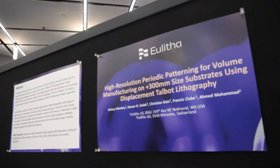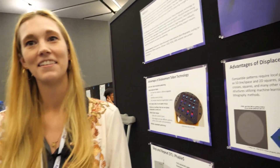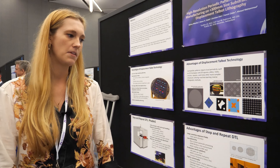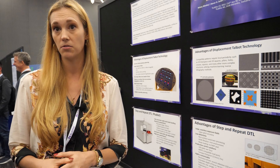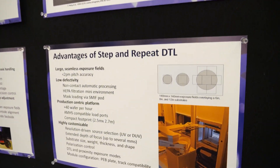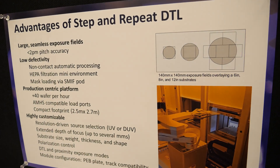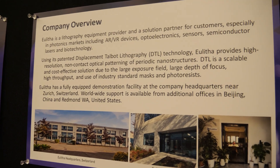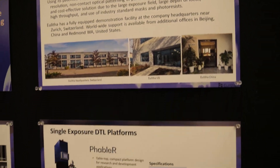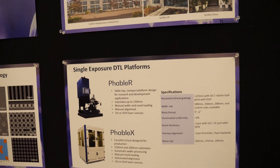So what's the role your company is doing right now in the display industry? Our role here is looking for alternative lithography that's lower cost and more reliable than some of the other options on the market right now. For example, with nanoimprint, you struggle a lot with defectivity, yield issues, cost issues — masters are expensive. It's difficult to scale to panel size with a lot of the strategies, whereas ours does very well with that. You have that cost savings scale with the large substrate. That's one of our main reasons for being here at Display Week.